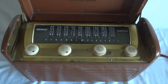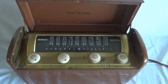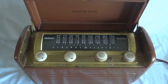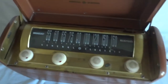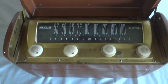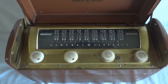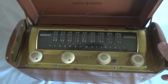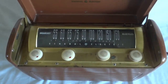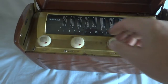The radio works on 2 volts from a lead-acid battery and also has a built-in charger. Of course, those batteries are kind of rare nowadays, so I have it on a power supply — I'll show you that later. It has a mechanical vibrator to bring the 2 volts up to about 90 volts. Those vibrators are very difficult to find, so I have a solid-state vibrator in there now.